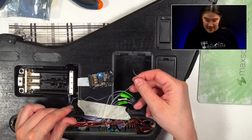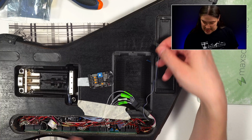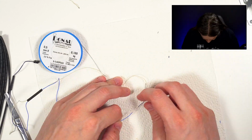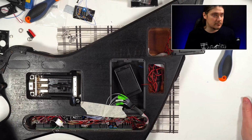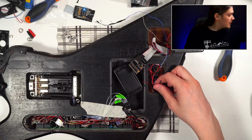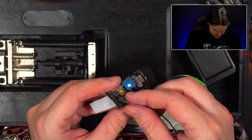The cable that came with the preamp is too short and will not reach from the Hexpander to where the preamp is going to be located, so I will need to make it longer. And here's the part I kind of hate, which is squeezing any cables into those thin, long channels between cavities. That's a nightmare. At some point, I've started using a piece of a 3D printer filament, which is flexible but still solid enough to be able to push the wires through.